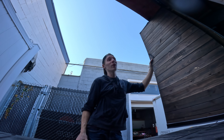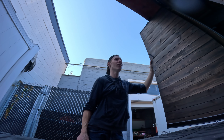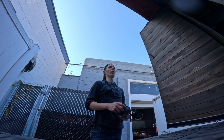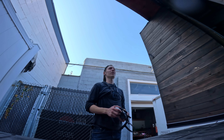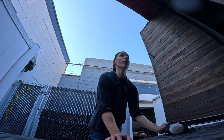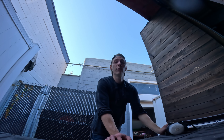I don't know if I want to put that spar urethane on when it's still wet. I think instead of putting that spar urethane on next, what I'll do is go ahead and start staining the walls, and then get a fan blowing on this thing overnight and just try to really dry it out before I put anything back up on the ceiling.